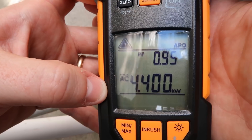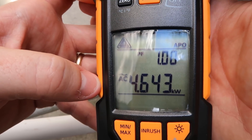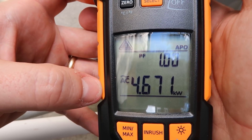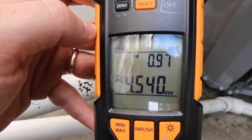We can now use this to actually calculate the EER of our system — figure out our BTUs and our wattage and use those to calculate our EER. It's a nice feature that the Testo 770-3 has that most meters do not have, and it's nice to be able to prove the amount of power a system is consuming — not just the wattage and voltage, but also being able to calculate the power factor. As with all high quality Testo products, you can find them at TrueTechTools.com. Use the offer code GETSCHOOLED for a great discount at checkout. Thank you for watching.